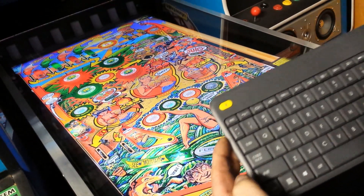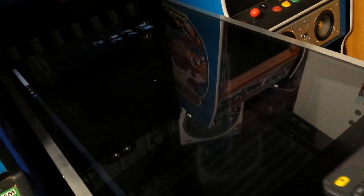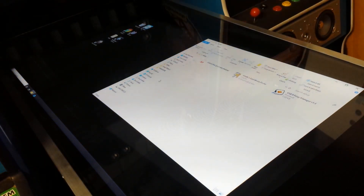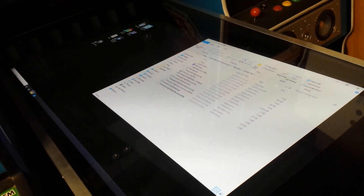We're going to press Escape, and that will take us up to the menu. I'm going to go into my setup — I've double-clicked on my setup. We're going to go into Pin 2 and Pinscape. Double-click on that and go into Pinscape, because the KL25Z board is a Pinscape setup. Now we're going to go into Configure Tool, then Pinscape Configure Tool EXE shortcut.